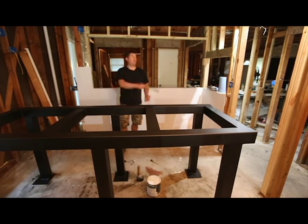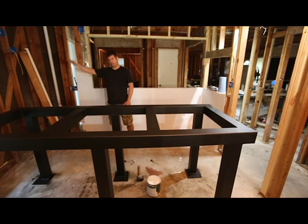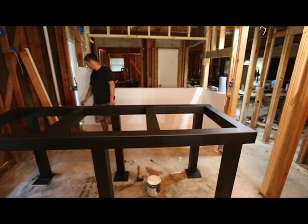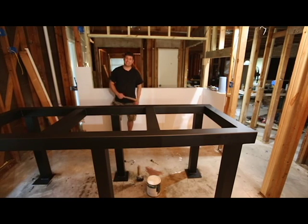Some future segments are going to cover framing in the area above the aquarium, framing in the little closet that goes next to it, putting in all the equipment, and building new sumps to go under the aquarium. It's going to be interesting because I've not done under-tank sumps before — I really don't like them, but at this house I have to. I also have a wonderful drain line because I thought ahead. We actually cut a slot in the floor, excavated some dirt, installed the plumbing, tied it in when we redid the bathroom, then tied rebar into the existing slab and poured new concrete. It's a fabulous amount of work, but for those of you with big tanks — go big, do it right, or go home.